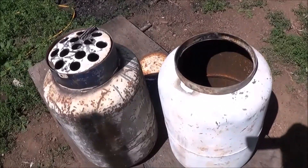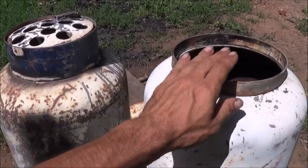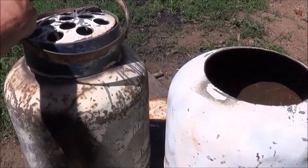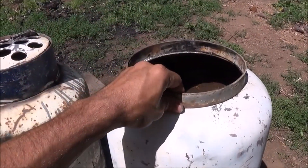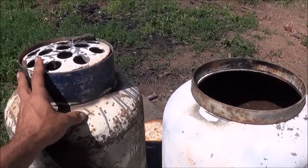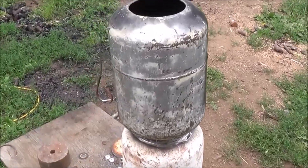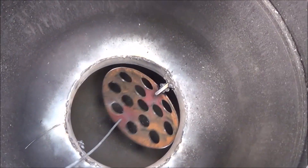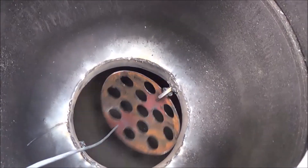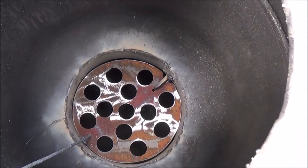At this moment what I'm doing is beginning to work on the lower ash chamber. What I've done to get the hole that I've cut in there is use the ring from this other tank that I've also used to get the diameter for the reduction zone. This ring slides over our reduction zone nicely. I used that to set that down there, got my center, marked it out and cut that hole in there. Now what I'm going to do is weld this ring to this can right here. That'll allow me to turn that upside down and slide that down inside the ring. I've got the upper and the lower now able to sit down inside of each other. I finished the screen that was in there. You can see the cable coming off of that going down to a little peg that holds the loop. All I've got to do is unhook the loop and we can now clean the screen. You probably only want to shake it just a little bit like that, then pull your loop down over that peg and it's going to hold it there and your screen shut.